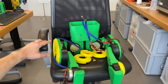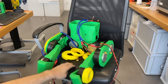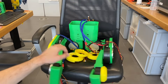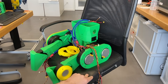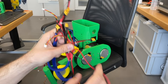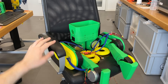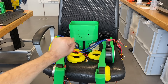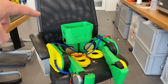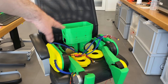Next we need to make the cables — I am about to do the wiring. I have dismounted the cowl from here and over here. I'm looking at how to route the wires. This is the wire for the right leg — as you can see it's quite complicated, and this is not even the complete wire yet; I still need to put connectors at the end. I've put this one just to check the lengths I need. This is the back of the robot where I'm going to fix these wires. I think I'll need maybe two more days because I need to dismount all the actuators and calibrate them — they're not yet calibrated.